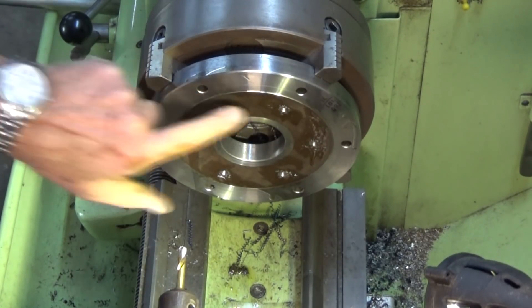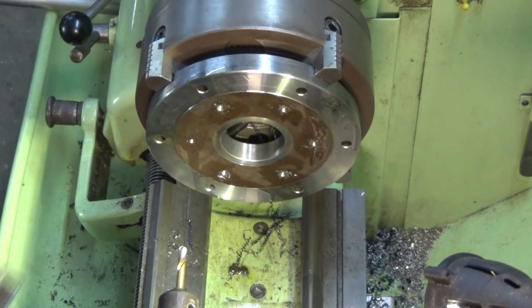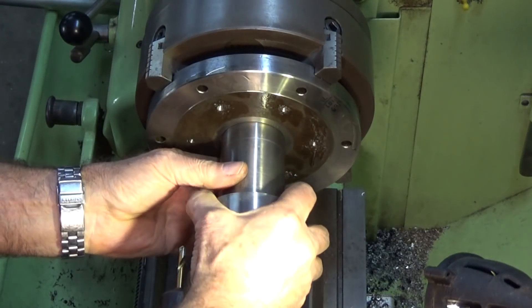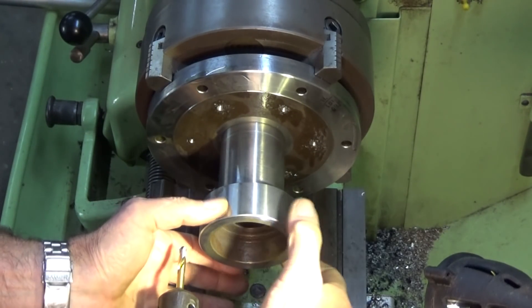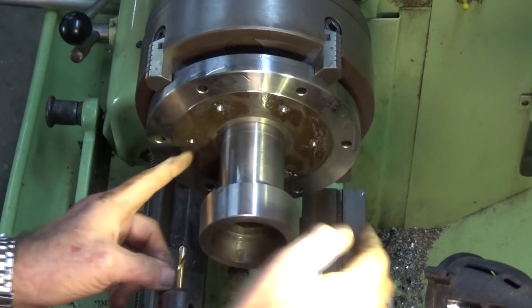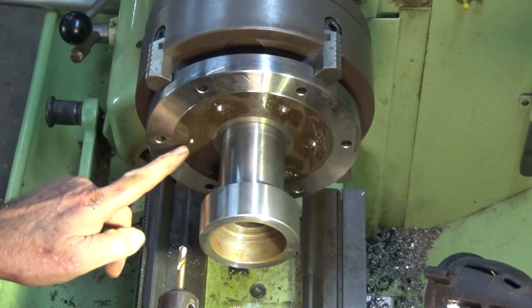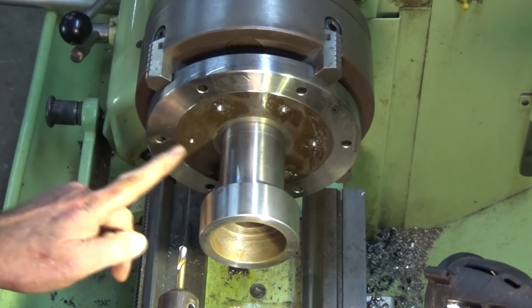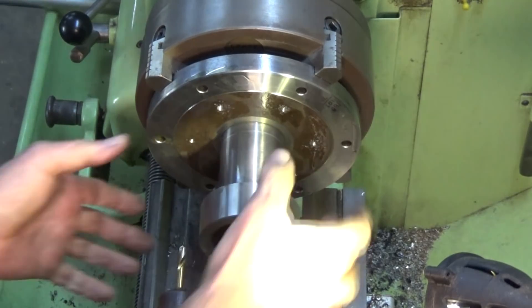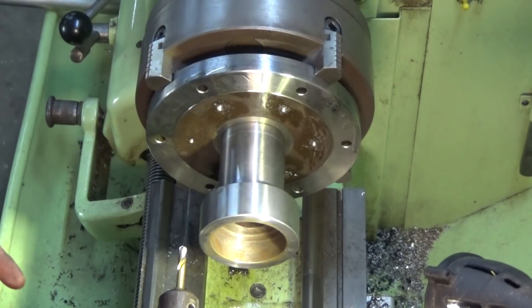There are my ring of six holes indexed around there, and they line up with the original six. That way when this assembly goes together and it's all welded, I can still fit my pulley over this larger boss here, and I've still got enough room to bolt through the pulley without interfering with the V-groove. I'm shooting for a finished RPM of 22, so the pulley that I'm putting on here is going to be slightly bigger than the drive pulley, and I've calculated that out so it's going to give me the correct ratio.